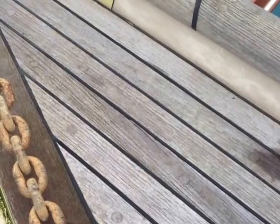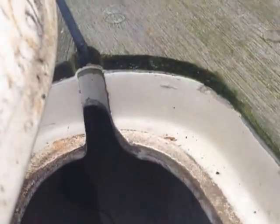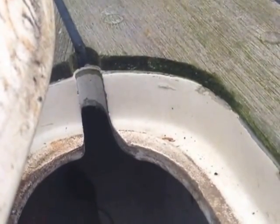The first thing on this boat: the teak, being a Swedish-made boat, was probably around 10 to 12 millimetres thick when it was new. This can be seen up on the bow here where you can see the original thickness of the teak. In areas on this particular boat, sadly the teak is quite worn and could have lost as much as half of its thickness in some areas.